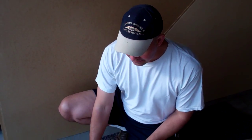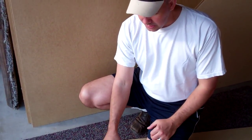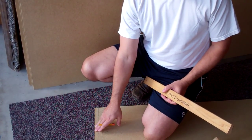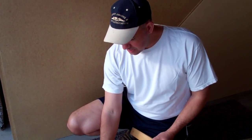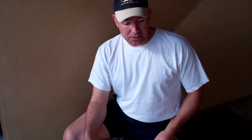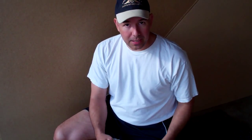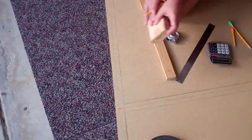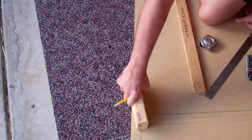To mark — as I noted in earlier videos — make sure your top edges and rear edges of the sim cockpit are actually an eighth of an inch wider than the rest. So instead of all your perimeter pieces on the top and back for the CS-1 or the HX-1 being an inch and a half, they're actually going to be an inch and five eighths. When I say inch and a half, I'm referring to the width of a 2x4. Because of that, when you're going to mark out where that ¾ inch dimension needs to go for your screws, you're going to mark this from the inside edge. You can see here that I've already marked out my 2x4s — that was the wall frame section — and now I want to mark out a center line where I'm going to make my screw holes.